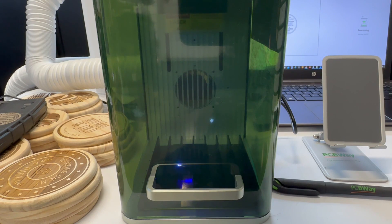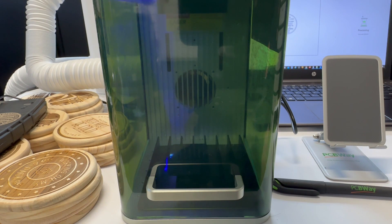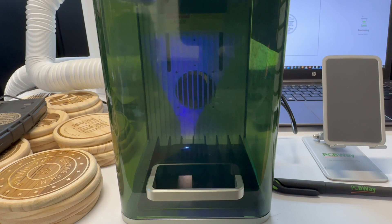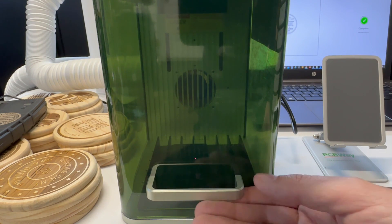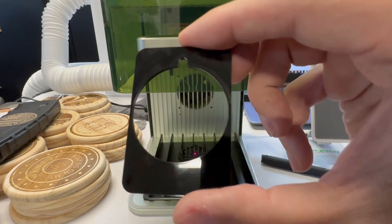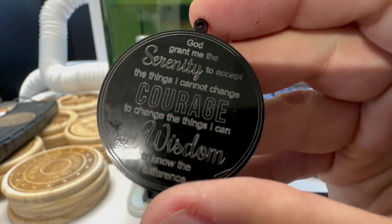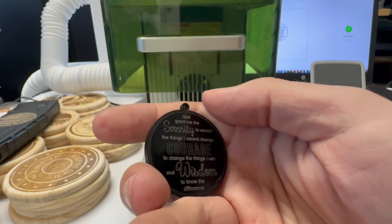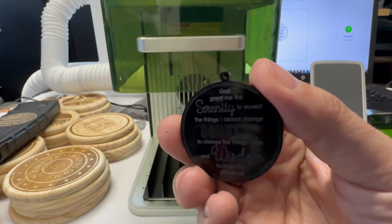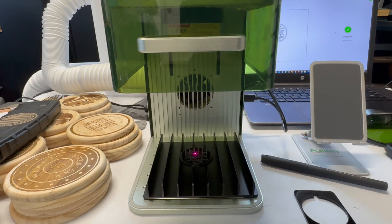What's unique about this is we can actually use both lasers for one job without having to switch. Right here I'm using acrylic — using the IR at 90% power, 100mm per second and two passes for all the lettering. Then using the blue laser at 100% power, 4mm per second and three passes to cut it out. Lifted right out. The IR makes the lettering come out nice and white. And because the laser goes on an angle, you'll get kind of an angled cut. Came out very sharp and nice.